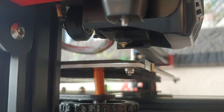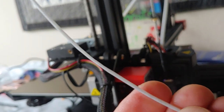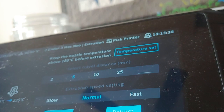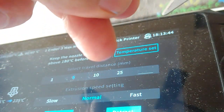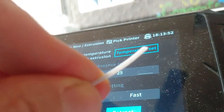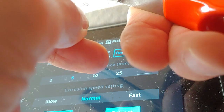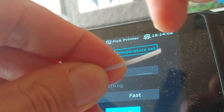I did that about 10 times but it still seemed to have resistance. I'm going to cut this filament off at a point where it doesn't have any damage from the extruder mashing it. Just feel where the filament is straight again and doesn't have any flaws, then cut it at a slight angle. If the tip flared out, cut it the other way. You can cut it this way just to get that little sharp tip, fold it over and off.